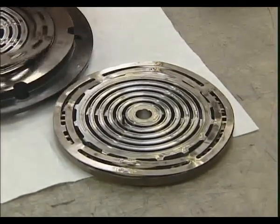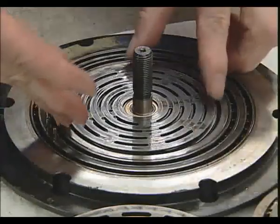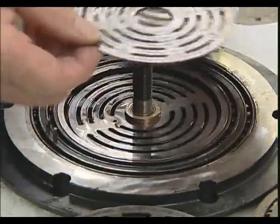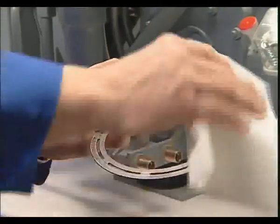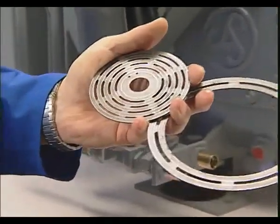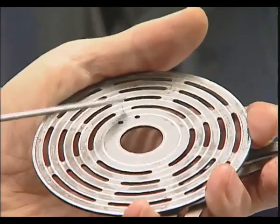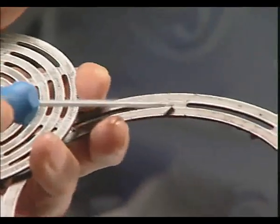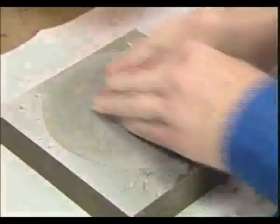The valve body consists of the upper part and the lower part, as well as of the internal parts. These internal parts consist of a valve plate and corresponding valve springs for both the suction and delivery. Valves are among the parts with the greatest stress in a compressor. However, slight markings can occur after only a few operational hours and do not impair the function of the valve. The maintenance intervals for the valves of the three-stage air-cooled Sauer compressor are 2,000 hours. Within this time period, no checks are necessary.